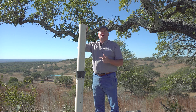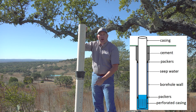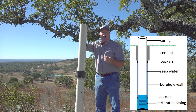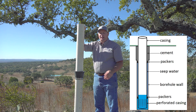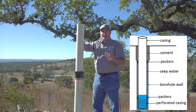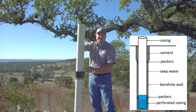The biggest problem we have with fiberglass is the collapse pressure rating. So what is collapse pressure? After we drill a well, we pull all the drill stem out and slide the casing down the hole. The first thing to go in is the perforated casing, which lets the water in from the aquifer. Right above that we have a packer — this is a shale trap. It seals between the casing and the borehole wall and catches all the sand, clay, gravel, rocks, and bad water that may be present above your production zone. Once that seal is set, water builds up on the outside of the casing as it seeps in over time, and that water is trying to crush this casing — just like water tries to crush a submarine when it goes down deep. Every 100 feet of water is 43.3 PSI, so if this packer is at 600 feet, you'd have about 260 PSI trying to crush this casing. And that is collapse pressure.